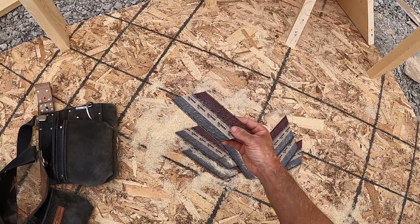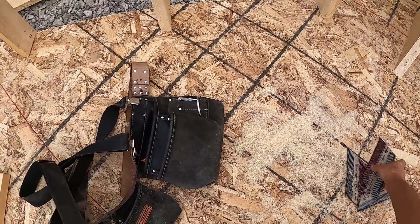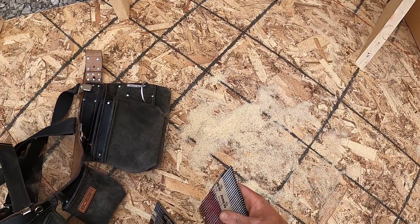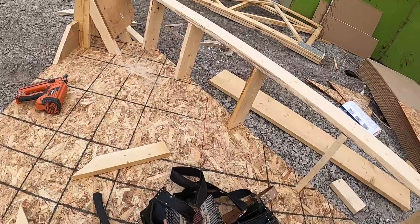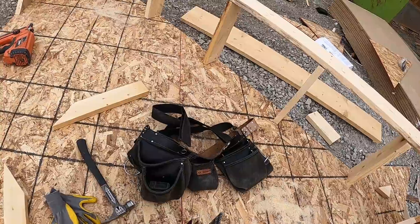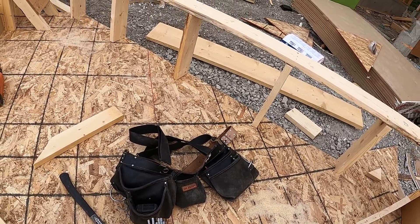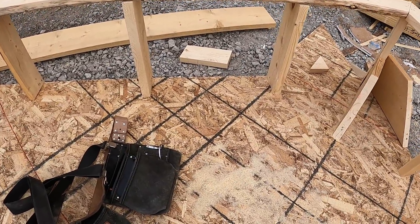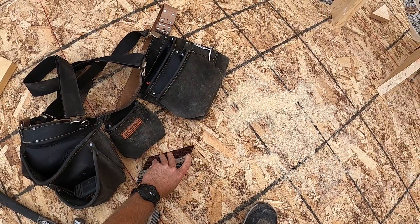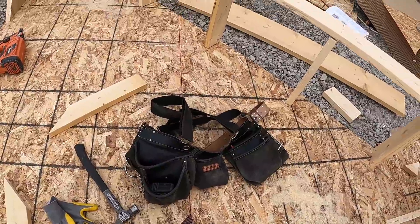If I'm working on the roof with strip nails, I usually have about 20 strips. I like to keep them organized — when you get them I take the extra two seconds to separate them and put them all straight. The reason is when I'm pulling them out they just slide out and I don't have to fight or maneuver with them in the air.